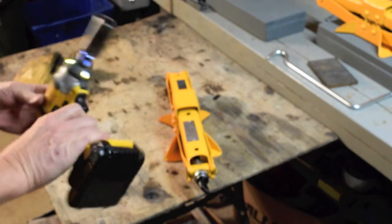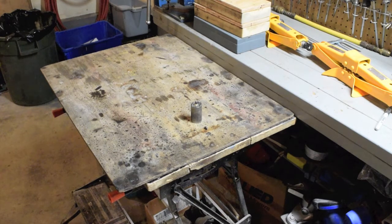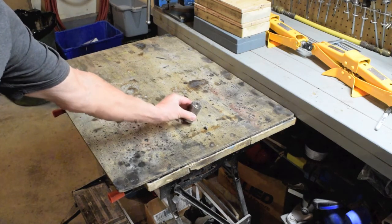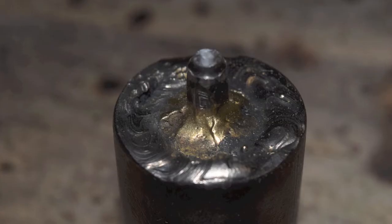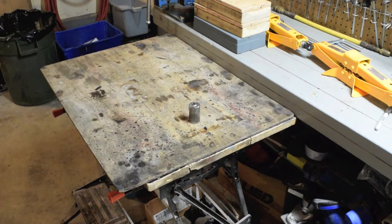It works pretty good — give it a try under the trailer. I thought this might happen: the original quarter inch quick connect shank wasn't strong enough, or I weakened it during the brazing or welding operation. After about 30 seconds of running the jack, the end of the shank broke off right at the narrow interlock part. Now it's time for plan B.